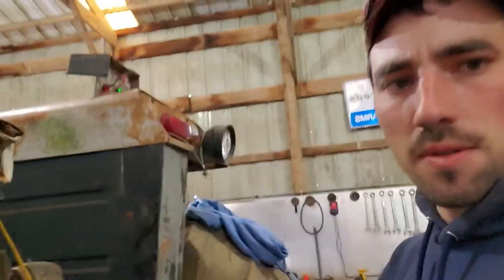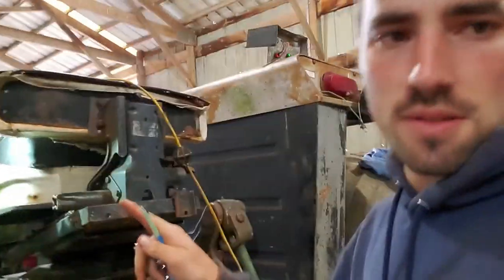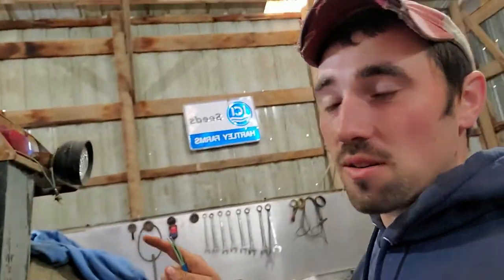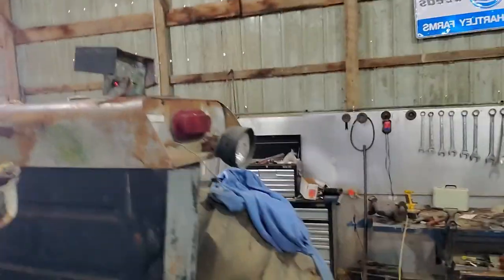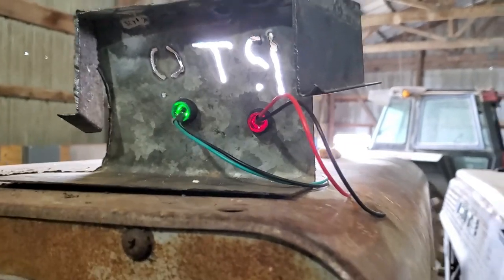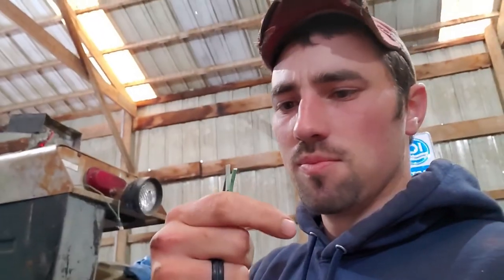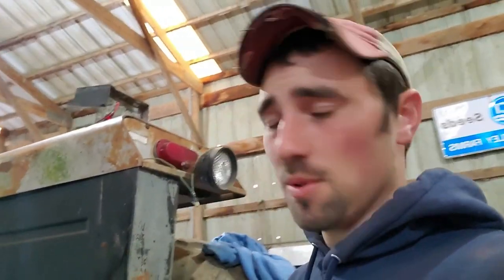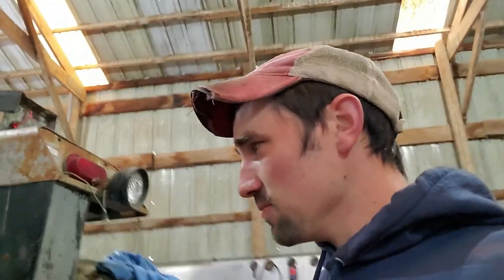Correction on that last one. So I need two wires for positive. That'll come one off each switch, so go up to there, which hook into those. And I'll pigtail those grounds. So I got two for each light and one ground. I think I knew that, and that's why I grabbed a three wire instead of just running a dual speaker wire. So I knew that. Just remembering.